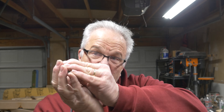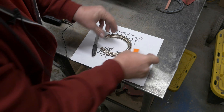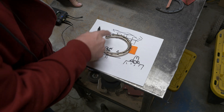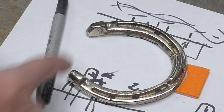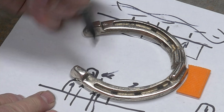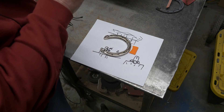That is not an air bubble, it is not porosity, it is not something poured in as a bubble of air. That is the effect of that metal shrinking away and forming a void inside the metal. What I should have done is put some kind of big feeder over here on top of the gate coming in — that might have helped. I could have just as easily had the shrinkage in these other corners too. If I were to cut those open, I'm not 100% sure I wouldn't find a void there as well.